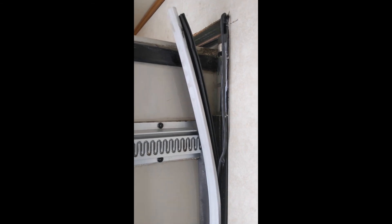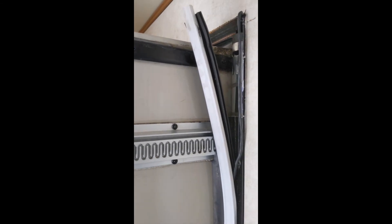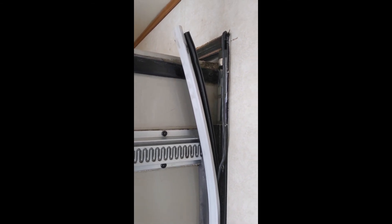I only ran the slide out about a foot, just enough to get it out. And I noticed that when I took the motor out, despite having sat for a good 20 minutes while I was cutting the channel, that motor was very hot. So there's a pretty good chance the motor had burned out. I think I made the right decision here.